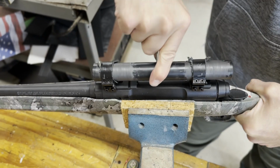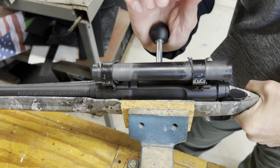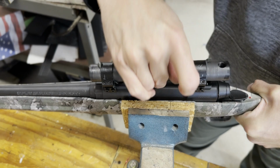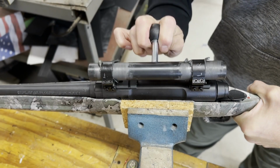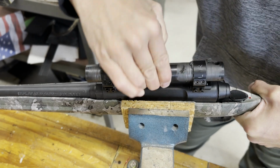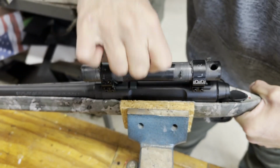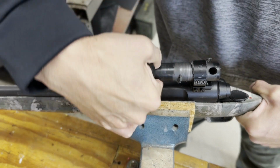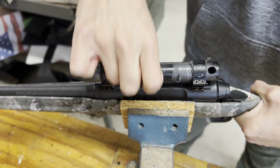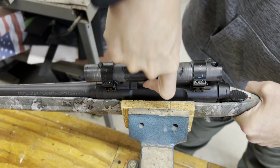This is a little tough. If you can see the struggle I'm having on camera. Trying to work in a cross hatch pattern, front to back, side to side, that keeps fresh lapping compound coming in on the tool. As soon as this frees up a little bit, we're gonna test it again, and I think we should be there.